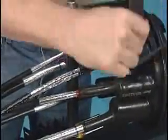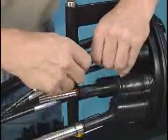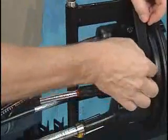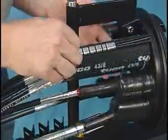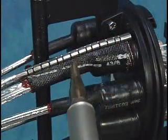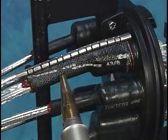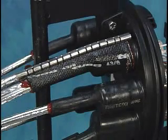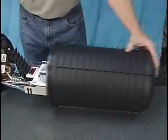Once the prepped new cable has been added, abrade the cable and port. Attach the SCOP adhesive pad to the new cable. Add the wraparound seal's Velcro strap to the port. Add the wraparound seal and shrink the seal. Notice the adhesive will flow at the end of the seal, indicating sufficient heat to the seal. New cable installation is now complete. The dome can now be placed back on the closure and the closure resealed.